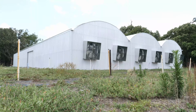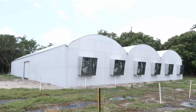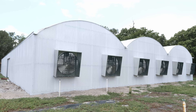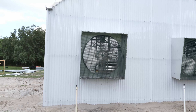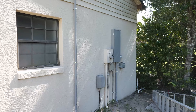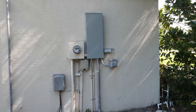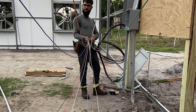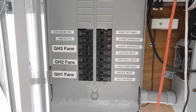Power got to be a little bit trickier because there are six exhaust fans that participate in the evaporative cooling process, and each pair of them — which there are three pairs — requires a dedicated 220 circuit, which is a lot of power. So that made us do two things: we had to upgrade the connection on our home from a 150-amp service panel to a full 200-amp. Then we ran four total feeder lines the full distance to the greenhouse to supply the 220 and put a 100-amp distribution breaker box in the greenhouse.